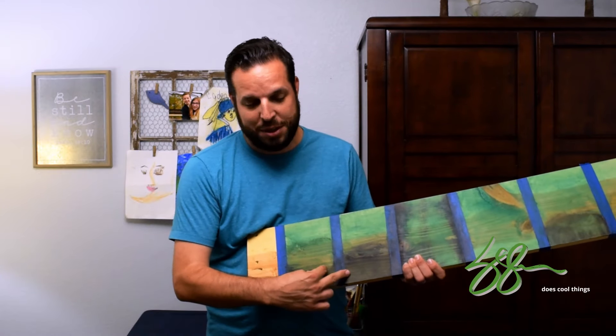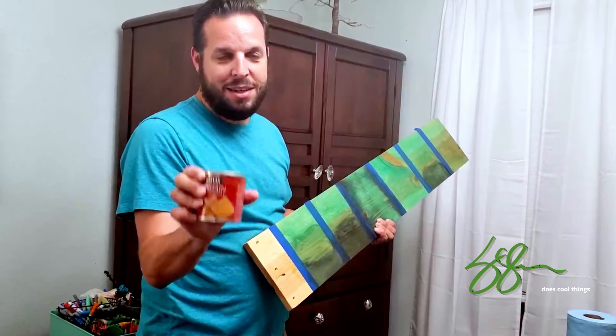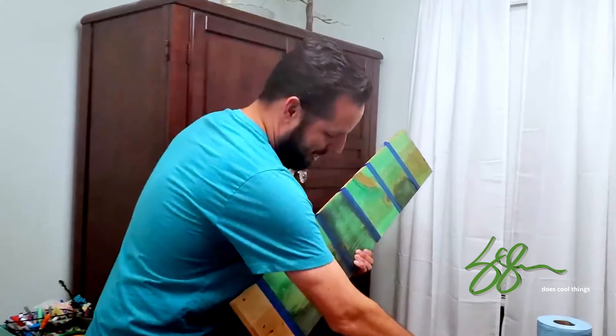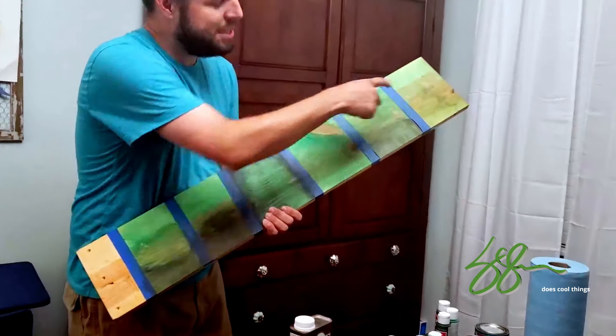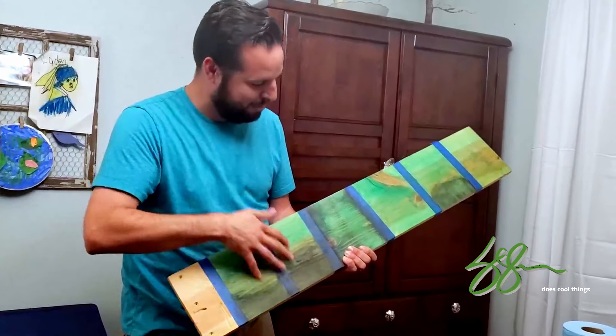Even better, I like these two that have been pre-treated with a Minwax pre-stain. What that has done is made it a little bit more even looking — it's brought out the grain just a little bit more than you would see on the others, plus the stain kind of pops a little bit better on those.